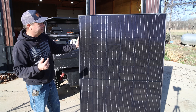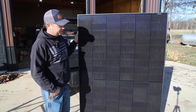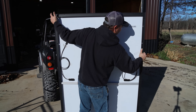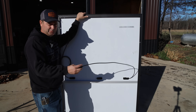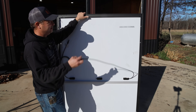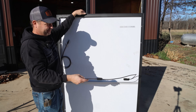This is a Canadian Solar 390-watt solar panel. I bought it off Signature Solar — they don't offer these anymore, I bought them more toward the beginning of the year. They always have really good deals, but the trick is you've got to buy a minimum of 10. When you purchase solar panels, pay attention to how long the wires are, because they sell them in multiple configurations. Sometimes the wires are short for portrait configuration, and sometimes long enough for landscape. I'd rather buy a longer cable and make sure I'm not short.